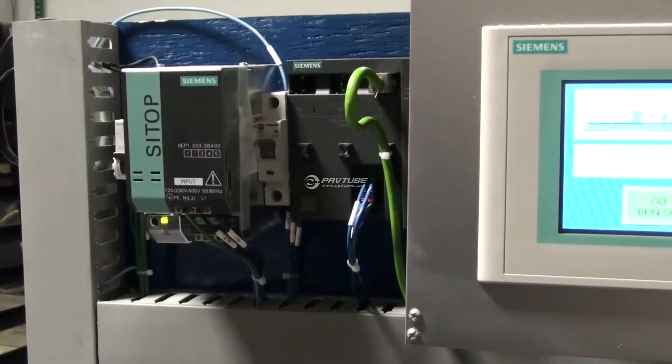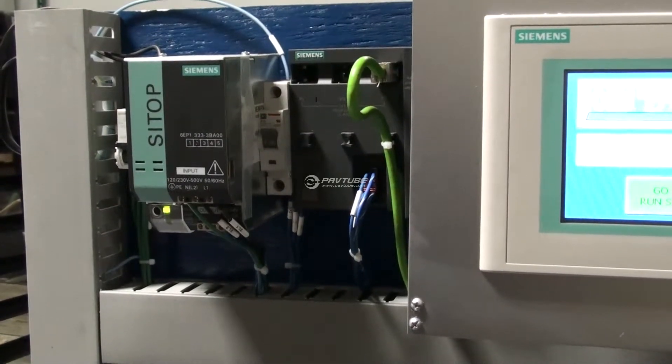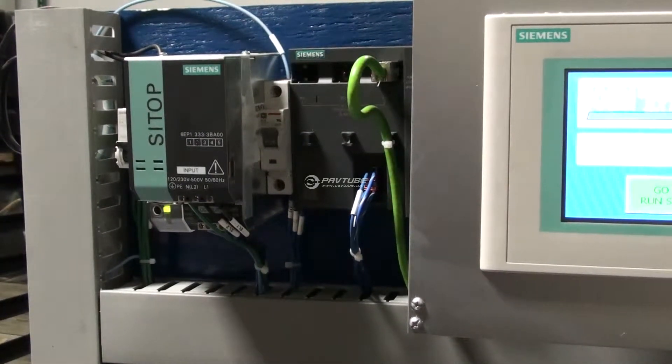The PLC, which is up on the upper DIN rail, has two relay outputs. One is for cold barrel interlock to the extruder drive, to ensure that the barrel is up to a safe operating temperature before turning the screw, along with a high temp runaway interlock. Some factories require a mechanical relay in front of the solid state relays, so if a zone overheats you can disconnect the power to all the zones at that point. Those relay outputs are available for wiring into your existing control system.